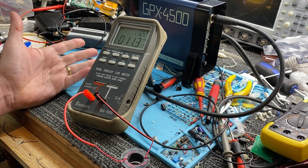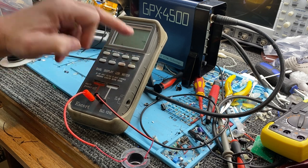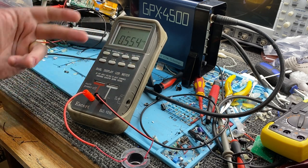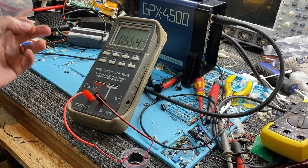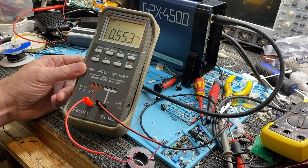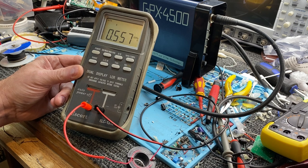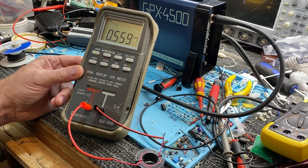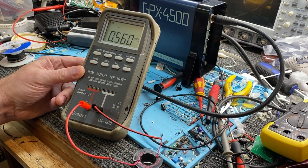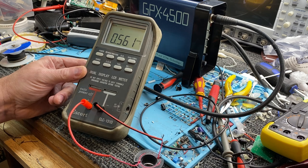We know that's very low. Let's have a look at the resistance — this has resistance at frequency. We want to do just a standard resistance measurement at 120 hertz. The other measurement's at a kilohertz, which adds impedance to it, so it reads the reactive impedance of the resistance because it's a coil, not a pure carbon resistor. And we've hit the magic number of 0.5 of an ohm.